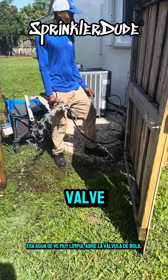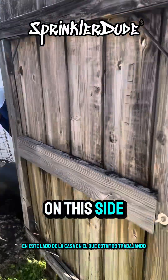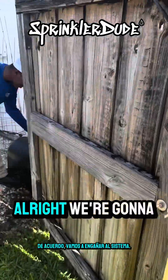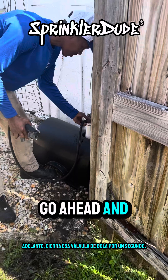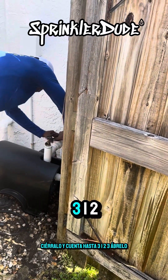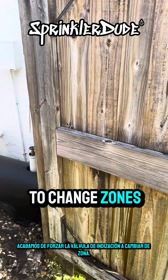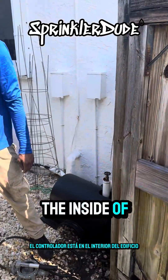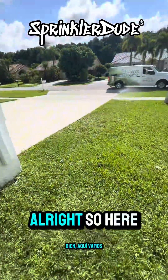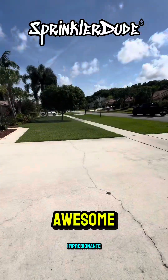We opened the ball valve — and it's just our luck that the zone on this side of the house we're working on is the one that comes on. We're going to trick the system: close that ball valve and count to three — one, two, three — open it. We just forced the indexing valve to change zones. The controller is inside the building and we don't want to walk in and out. Now we've got the front zone on.